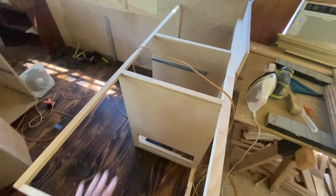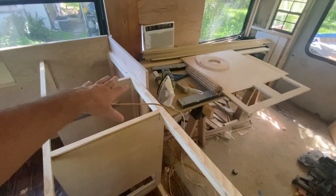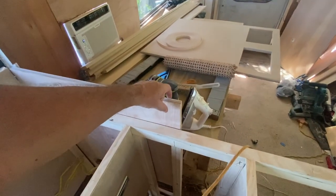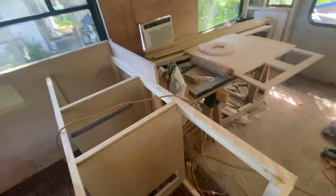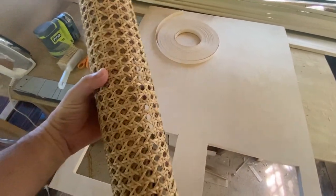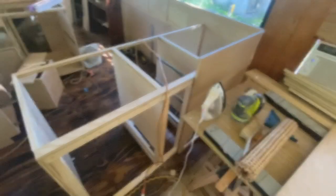The sink is actually the peninsula sticking out here, with these two big panels on the ends. This is going to have a stand-up freezer here and over there with the lid opening up, and these panels on the back of the cabinet will act as a backsplash as well, lining up at the same height all around. They'll have a small cap piece on top with a nice LED light shining down. Because both freezers are there, you want to make sure they have plenty of air ventilation, so I'm cutting big holes in the panels and backing them with rattan wicker material to keep good airflow and look spiffy at the same time.